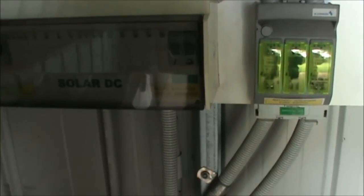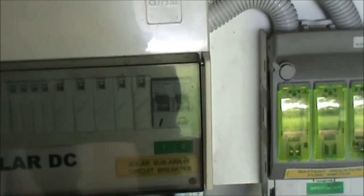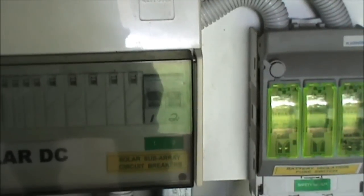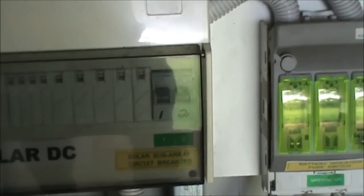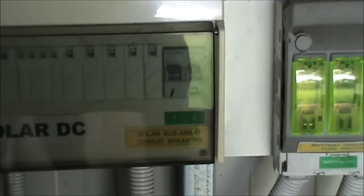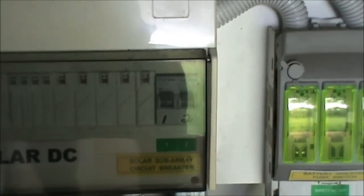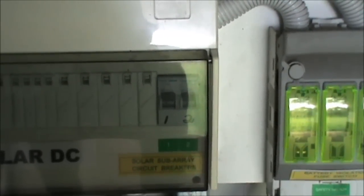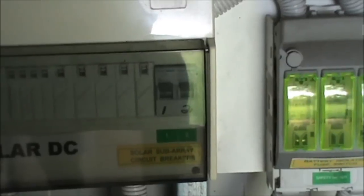The system has quite a few safety features built into it. What you've got there are two circuit breakers, and effectively what that does is, if the need requires or something happens, they're the two circuit breakers that isolate the output of your solar panels from the rest of the system. In fact, in later systems, even the grid-fed systems, this is a safety requirement, because even if the rest of the system is disconnected, those solar panels are still putting out quite a bit of voltage and quite a bit of DC amperage.